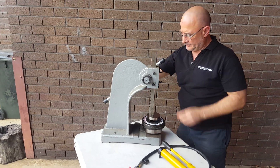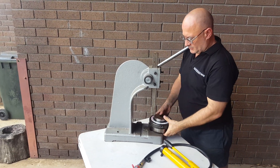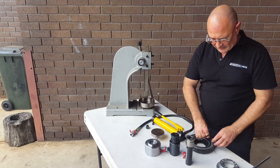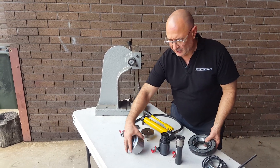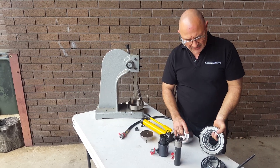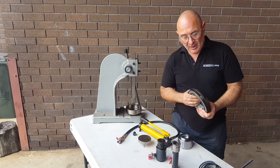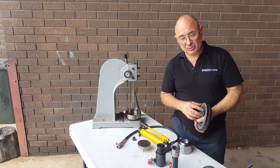Put that in — okay, that's out. Now, to do the next part, take out the O-rings. This is where the rings become quite unique; another little special tool will come in here and grab onto the O-rings. Traditionally, how this would be done is you have a block around the bar and you're beating this up against the bench. The problem is the rubber is a damper — that's why it's a super damper — and it takes away the shot from the impact. So when the O-rings are chewed out, it becomes very difficult to pull this apart.